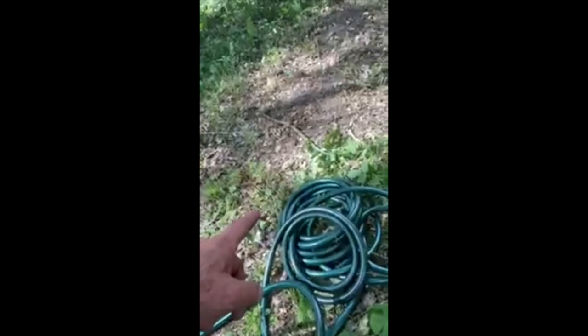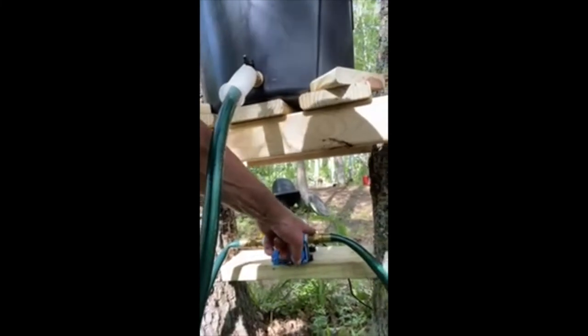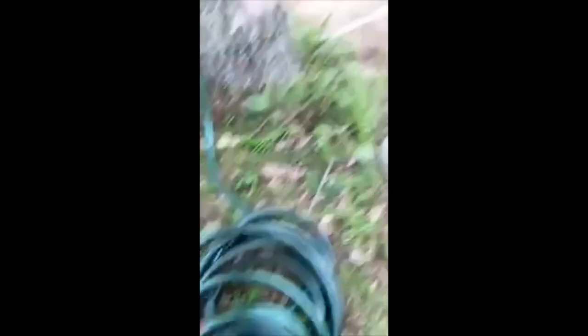Water goes down this hose, which we pretty much leave in the sun to help warm the water, then comes back up to this pump right here — water in, water out. This will go to the hot water hose that will get laid in the sun, and we follow that hose right here to a point-of-use water heater. I just made that stand to hold it off the ground.